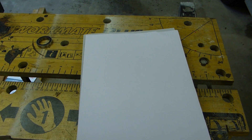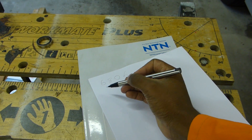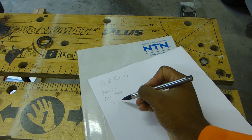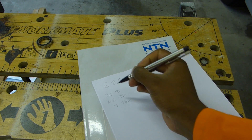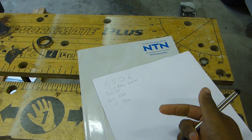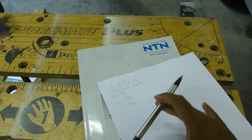If we talk about bearing numbering, let's pick a popular bearing: the 6806. The 6806 bearing is commonly used in BB30 and PF30 bottom brackets, with nominal dimensions of 30mm ID, 42mm OD, and 7mm thick. The first digit — the 6 — is the bearing series. 6 is a deep groove ball bearing, 7 is an angular contact bearing. On a bike, the vast majority will start with 6; 7 is rare and usually only on angular contact bearings on bottom brackets.